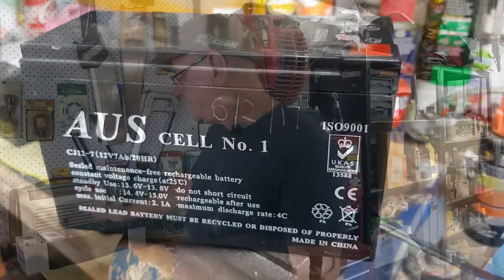Since I've got the solar I may as well use them. With these type of batteries they'll actually have a very long service life — up to five or six years — providing they're not drained down too heavily per day and the charge-up cycle is correct every day. These batteries are basically around two years old, so they've got pretty much another three years left in them. To put these into service I need to test how many of the six batteries are good enough.